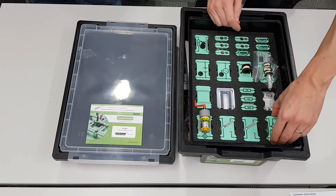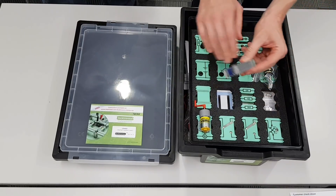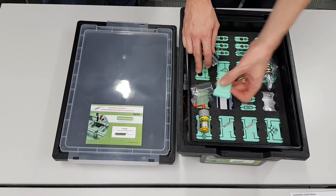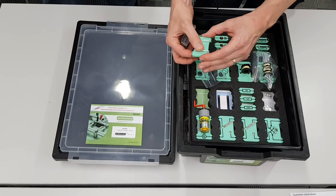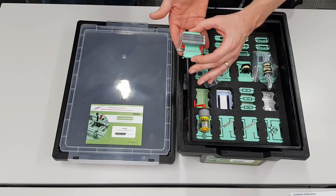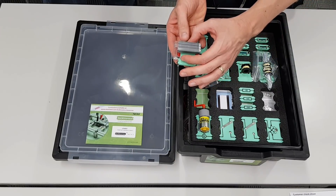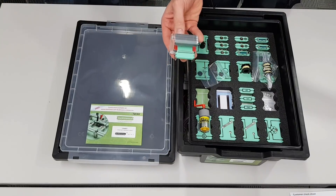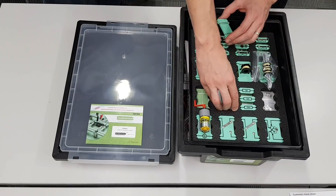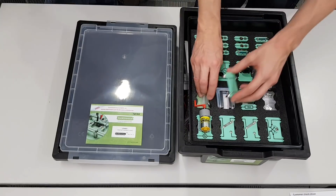The thing I'm particularly excited about is an experiment I saw about two years ago on this kit and I've been wanting to try it ever since. You've got a really nice illustration here of the force placed on a conductor when you run current through it in a magnetic field. The magnet sits around it, you put this little bar in, run current through the bar and it literally fires out — it's very cool. You can illustrate electromagnetic fields with actual moving parts, because they're invisible and hard to show.